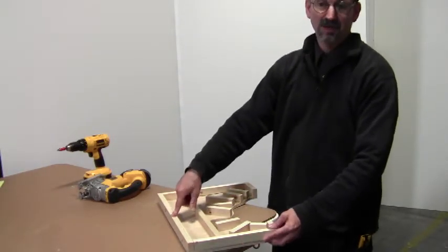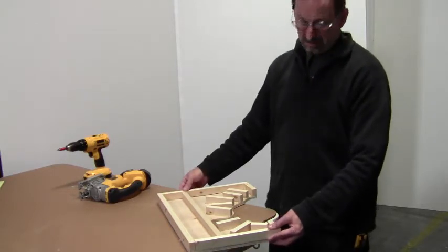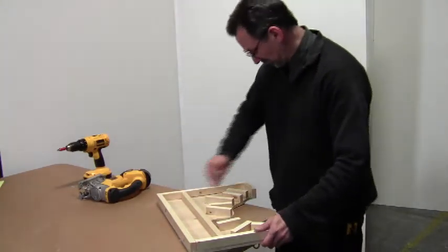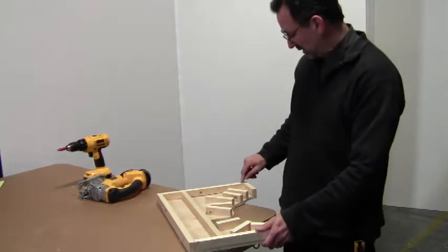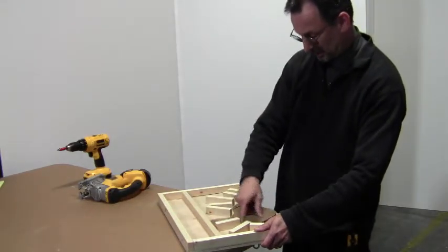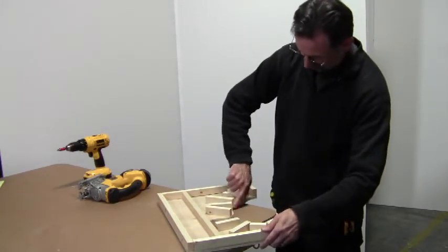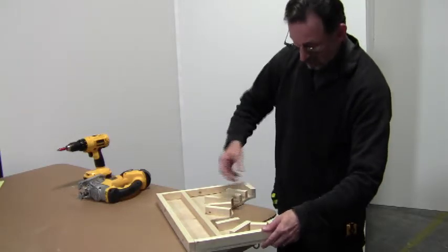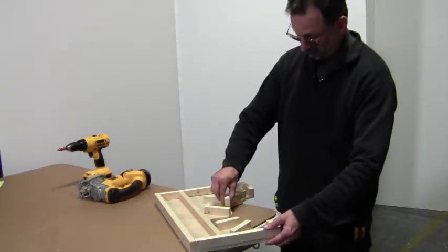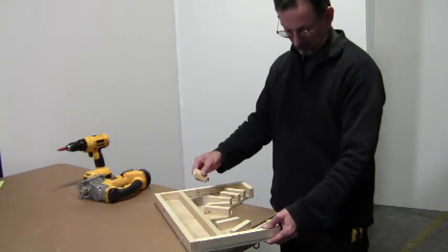These could be 2x4s or 2x3s, or even potentially thicker 1xs. Just depends on what you need. I've seen them up to 2x6s in this part, put together with the skin, and so we've got all of the perimeter boxed in. And then here, just so we don't have just two floating pieces of contoured plywood to attach to, we put in these blocks that line the two up. You can even put them crossways in areas that are larger, to give yourself larger surface areas for either attaching foam or getting a little more fancy.